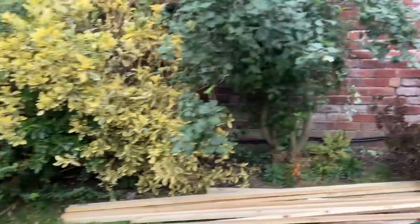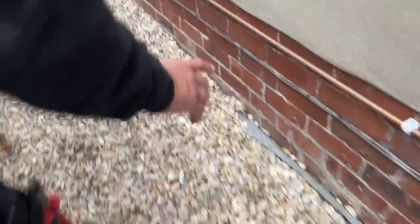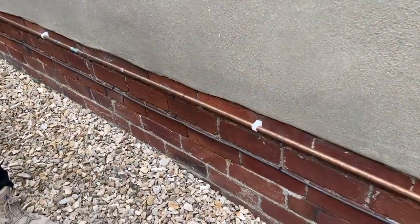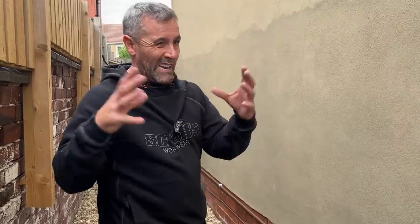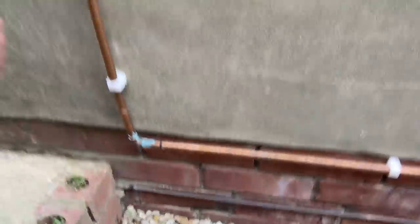You can see Tom and Lee are just finishing off skimming. The cable runs up that wall - it's probably the tidiest, cleanest route we can go. It drops down under the gravel, goes up here, cuts across, and approximately where I put a black mark - that's where the steel wire armour goes into the house. We're not going inside the customer's house as it's a bit of an intrusion of privacy, but basically the steel wire armour goes in there, we've terminated it, then we swapped to some 10mm twin and earth so the electrician Neil can connect up in a box. It runs through the cellar, up into the kitchen, and across to the consumer unit which is unfortunately in the middle of the house. The cat six runs along there and drops into the cellar because we didn't want to tack it up over the staircase - it would look messy.